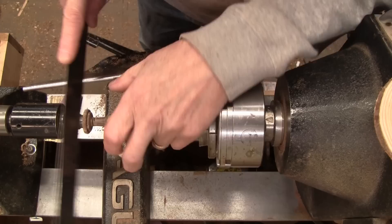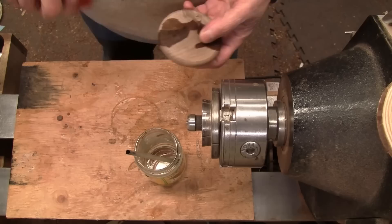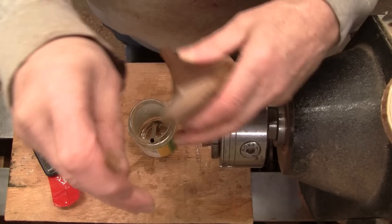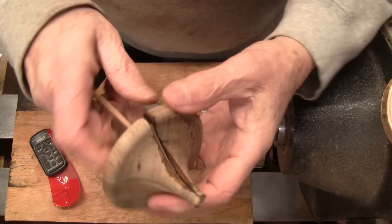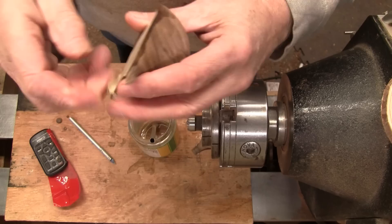What I'm using here is a very fine tooth blade — I believe it came off a power hacksaw. I'm putting some denatured alcohol along the joint and hoping it gets in there and softens up the glue on that double-sided tape. I've got a little tool here with a real thin blade on it. I took a popsicle stick and ground it to a feather edge so I can start it and push it down the middle. I already put a little alcohol in it, and you can see it's popping loose. I think I can just push it down in there and then we're loose.